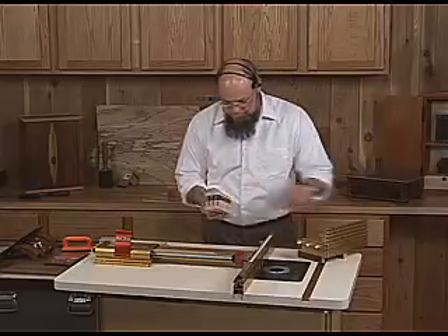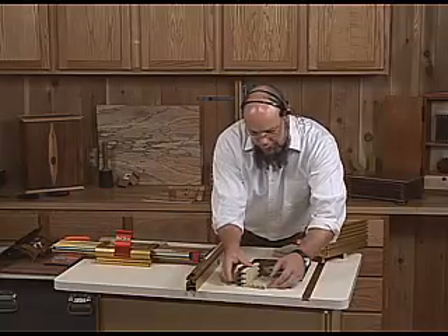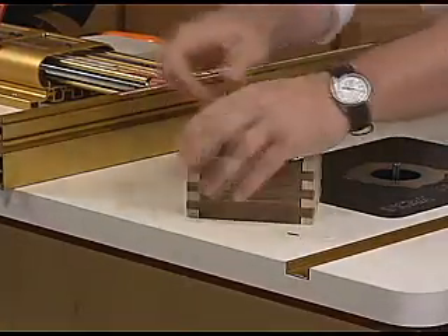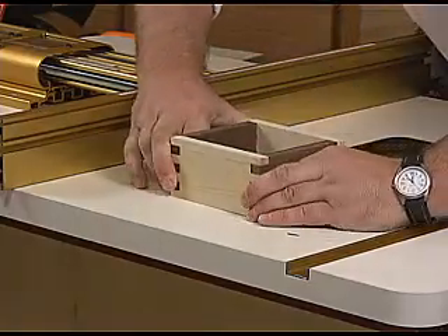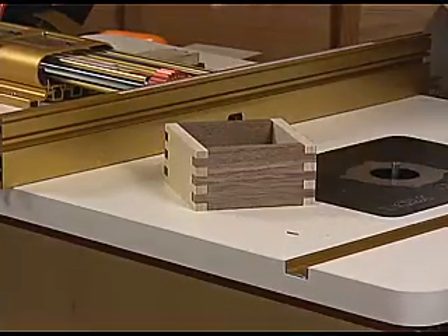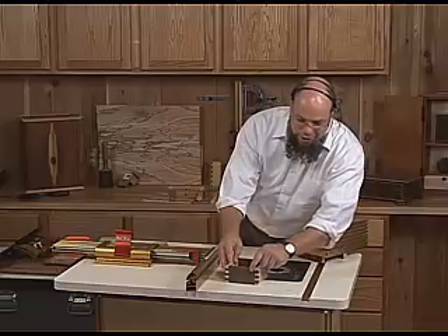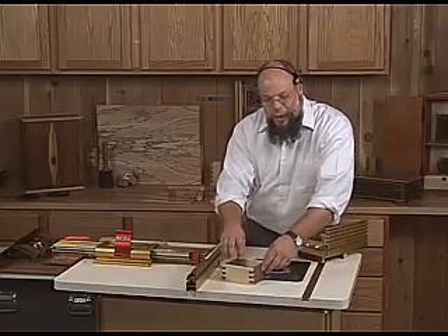All the parts are cut — front board, back board — and we put all these together: third side and fourth side. You can see that we've knocked together four sides of a box, done all at the same time, in a total of about three minutes worth of cutting. And because of the front board, back board, and the fact that every other board serves as a backing board for its neighbor, there's not a splinter out of place on any of them.